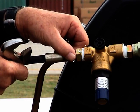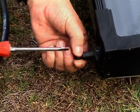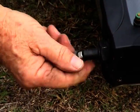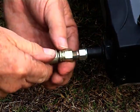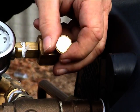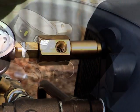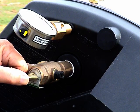Connect one end of the commissioning kit hose to the pressure reduction assembly. Remove the fill plug from the collector fill assembly. Connect the bottom end of the commissioning kit hose to the collector fill assembly and tighten all fittings. Remove the thumb screw from the test block assembly. Open the HT55 valve to fill the closed circuit with water.